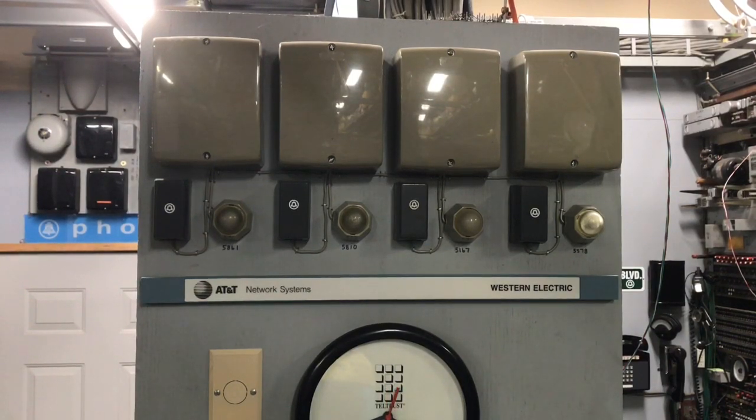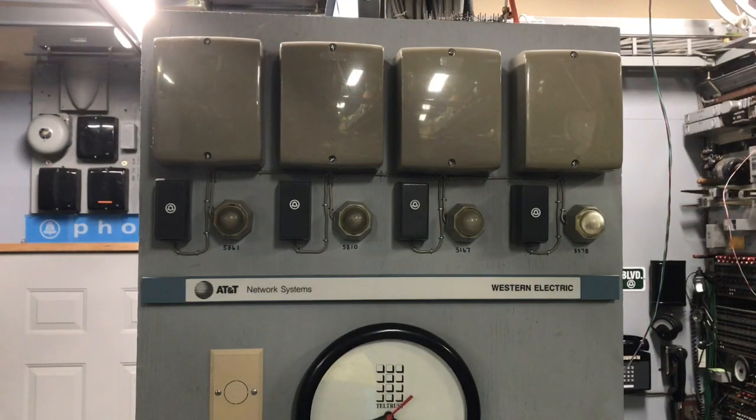For this episode, I will be demonstrating the ringers wired on a four-party phone line. This is one set of C4-type ringers, and it is using an electronic 28A ringer isolator — that is the black little item that's under the ringer that has the bell logo on it. There are neon ringing lamps to the right of the ringer isolator, which is below the ringer boxes.